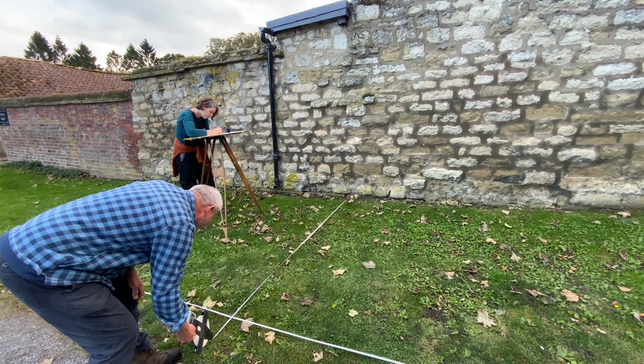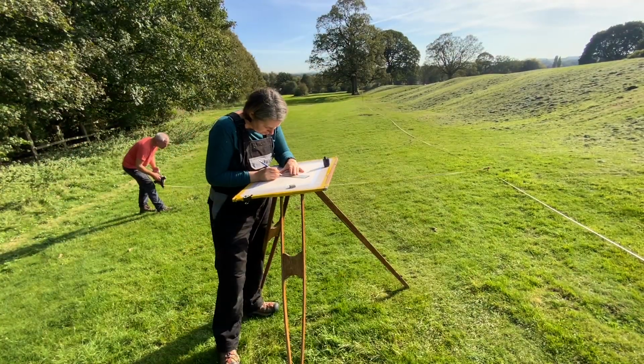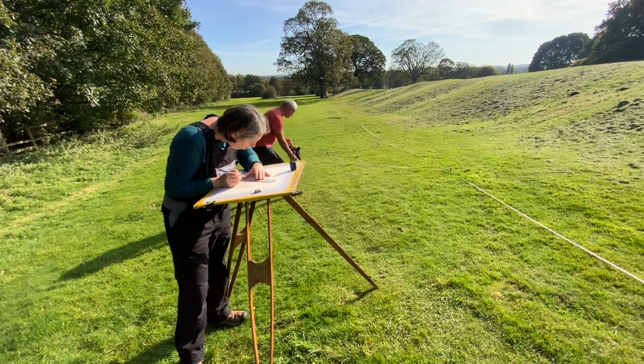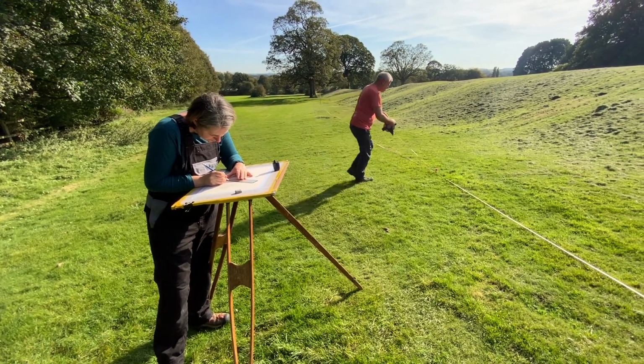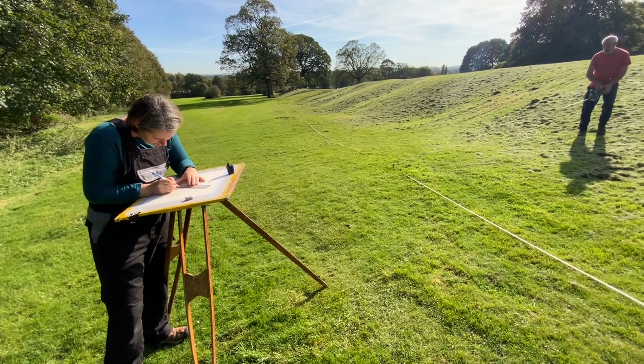15.9 gives 2.6. When surveying earthworks though, if you zero your offset tape at integers on the baseline tape wherever possible, for example 4 meters exactly, this will make it easier, quicker and more accurate for the person responsible for doing the drawing.